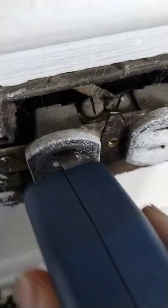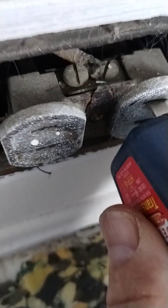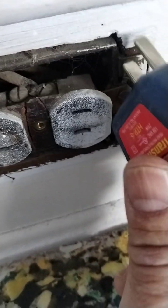And we have fractured insulators — see the insulator? Again, real sloppy, real sloppy. So this one's more likely to arc. Pull it off. All right, so test from your hot leg to your metal here.